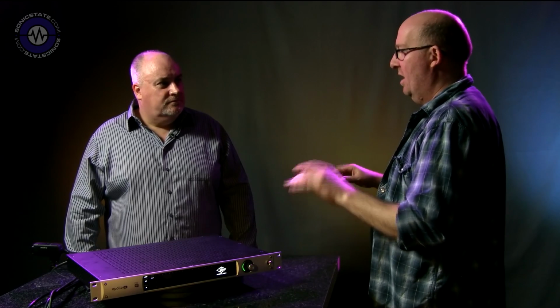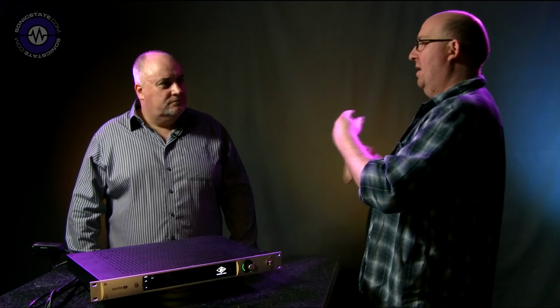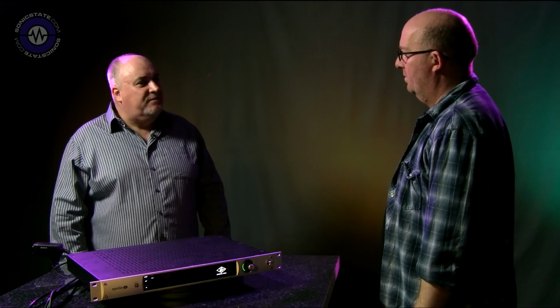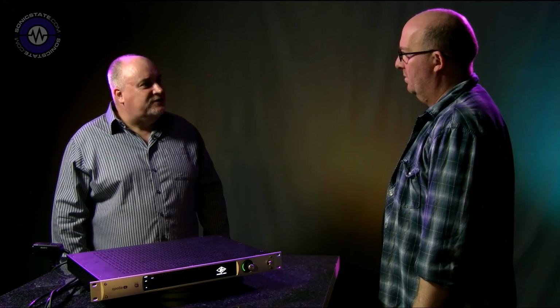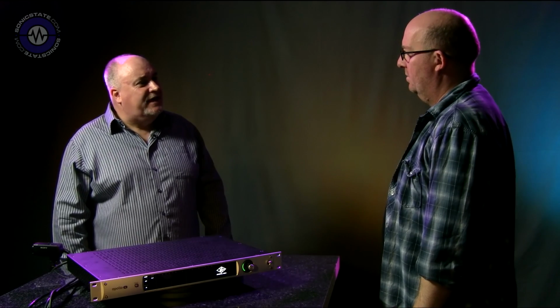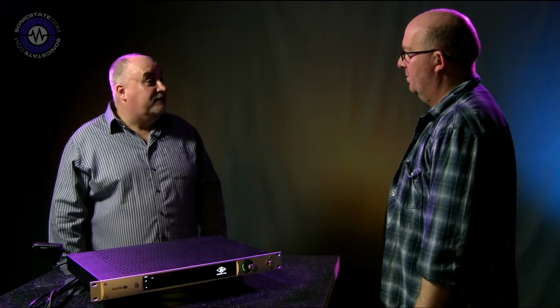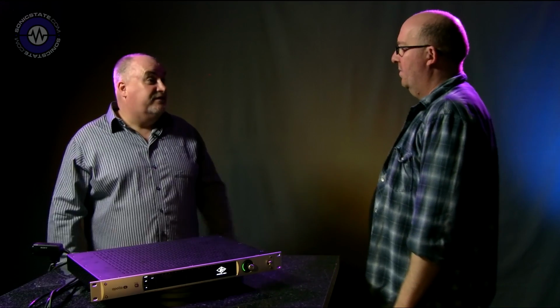So what typically? You're saying this is aimed primarily at a studio guy, right? So are there any expansions in the plugin range to take into account the extra I/O, or is it just more of the same? More of the same. When you look at the companies that we deal with, we're dealing with Lexicon, Manley, high-end studio products. So I think we already have the DSP plugins. It's just that people have said, well, I'd like to have more I/O in my system. I'd like to bring more signals in and out, and that's where the drive was to go to 16 rather than 8 for the analog I/O, and obviously with 2 units that can now be 32.